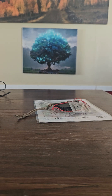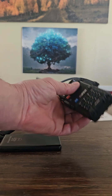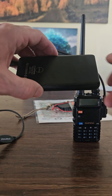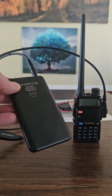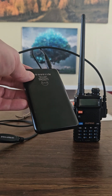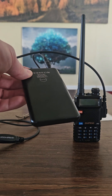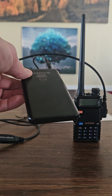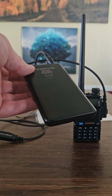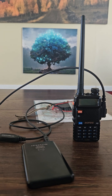A cheaper option is to use any radio with an APRS cable connected to a tablet, phone, or MP3 player. You put whatever audio you want in a playlist. You can find MP3s of complete silence so the radio will kick on and off — just put the silence MP3s in between what you want it to broadcast, and it won't constantly transmit. That's the main gear for direction finding and fox hunting.